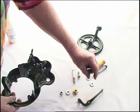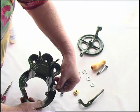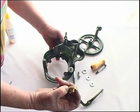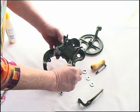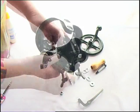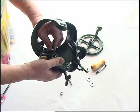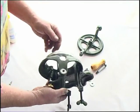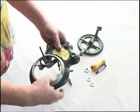First we take one of the screws, we put the spring on first, then the washer, and then we take the big adjuster nut and put it small side in first, screwing it in about half to three quarters of the way. We need to leave a little bit of slack to be able to get our cylinder in. Make sure it's going backwards and forwards — and there's our base together.